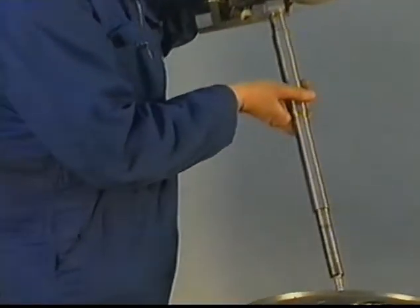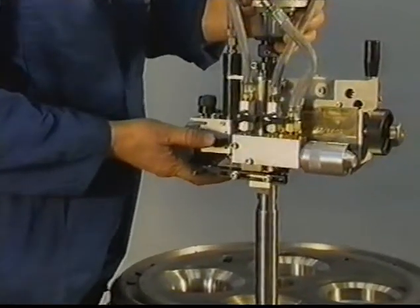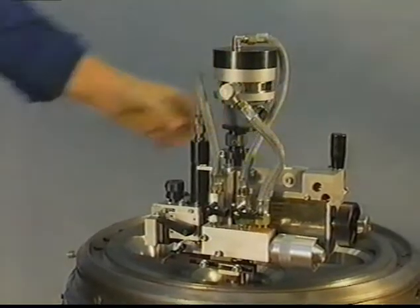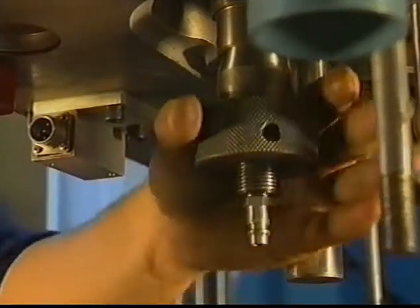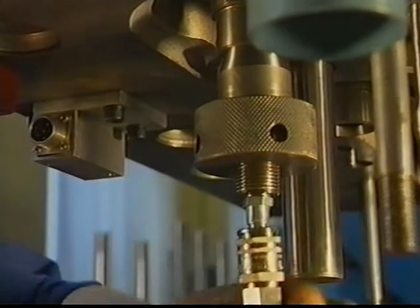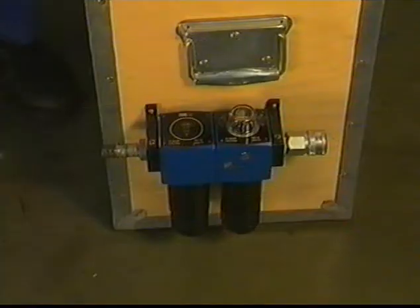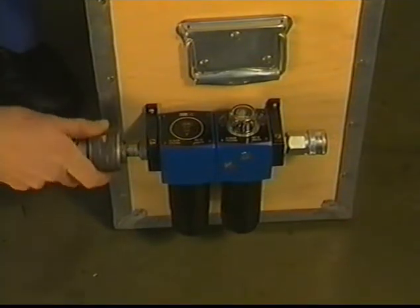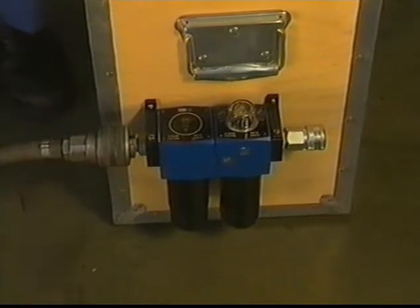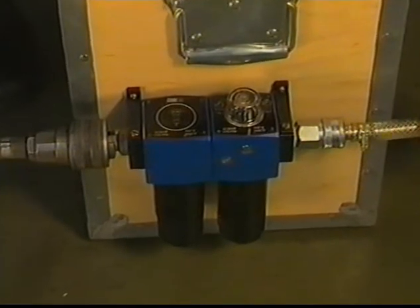Lower the valve seat grinding machine. Be sure that the correct spindle is used in the valve guide. Fit the tightening nut and tighten it by hand. Connect the air hose. Connect the air supply hose to the air conditioning unit. The air pressure should be between 6 and 9 bar. Mind the direction of the airflow.